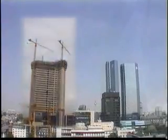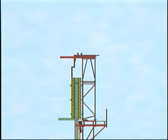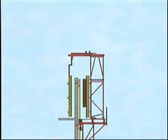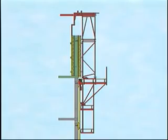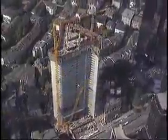PERI ACS embodies more than 30 years of experience of climbing systems. On this 186-meter-high multi-storey building in Frankfurt, for example, the inside formwork climbs with the outside formwork. Rationalization at its best, as even the window box outs are firmly connected to the formwork panel. The result is a high degree of accuracy and a fast construction sequence over 46 stories.